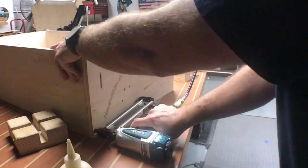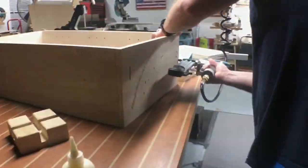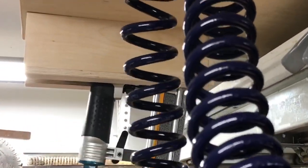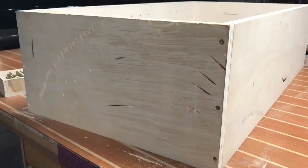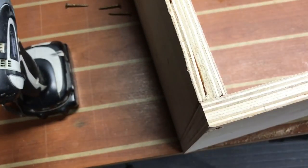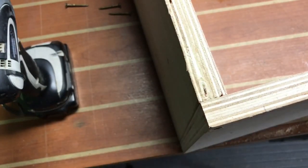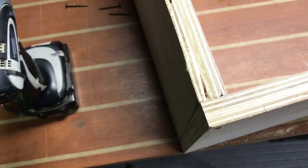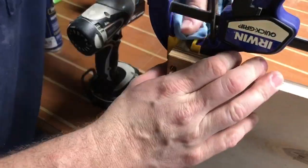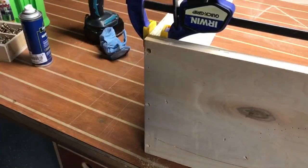Let's talk about pneumatic air gun storage. I recently put this thing above my head in a little bracket that rests against my plywood storage — it's made my workflow so much better. The hose isn't constantly being tripped over. As you can see, I'm reinforcing these joints with screws, but the ply split. A little CA glue — I clamp it shut with a squeeze clamp, put a little activator on it, and by the time I get those three screws in, that joint is completely fixed.